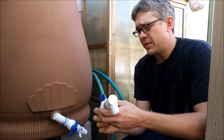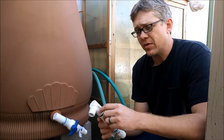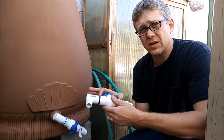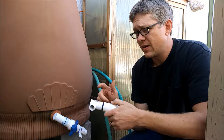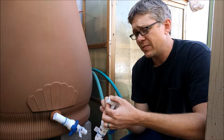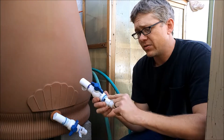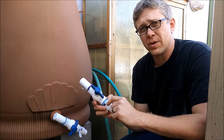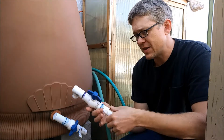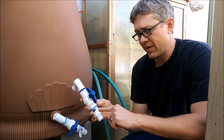All of these parts were bought at Home Depot. Most of them you'll find in the normal plumbing department where all the PVC pipe is. These are all three-quarter inch fittings and pipe. The valve is a glue-together fitting. This 90-degree angle is threaded on one end with fine threads you'll find in the plumbing department. This other fitting is something slightly different — you'll find it in the sprinkler department. It's a three-quarter inch MHT by three-quarter inch slip PVC fitting.